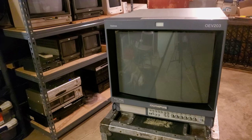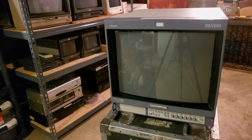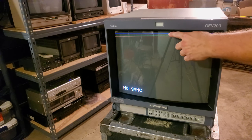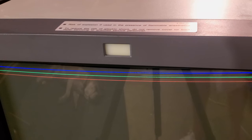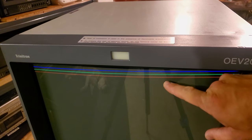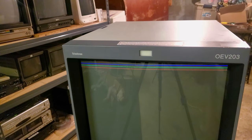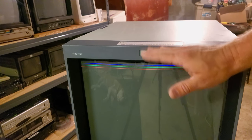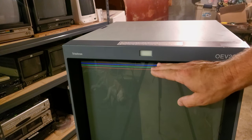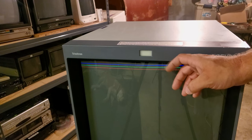The PVM is ready to be turned on and tested. I'm not even going to put any kind of video signal into this one — we're just going to turn it on, and it should show you the issue we have here today. Right away you can see up here at the top of our screen we've got blue, green, and red lines. Let's zoom in a little bit, and you can see very vividly at the top of our screen that we've got a blue, green, and a red line. That's our issue. We've got the red, green, and blue lines, which means a couple of capacitors have failed internally, which Sony did acknowledge in documentation later on after the production of these monitors.